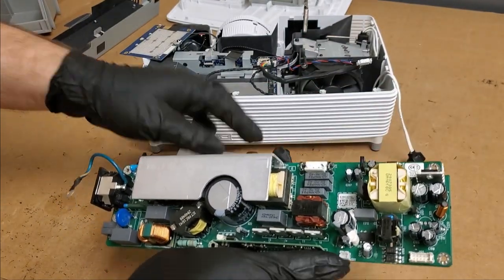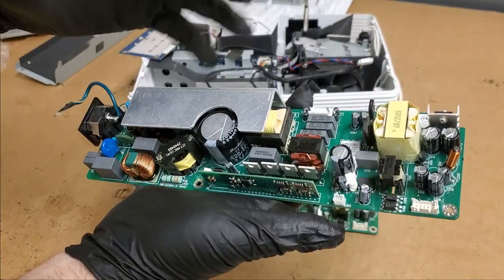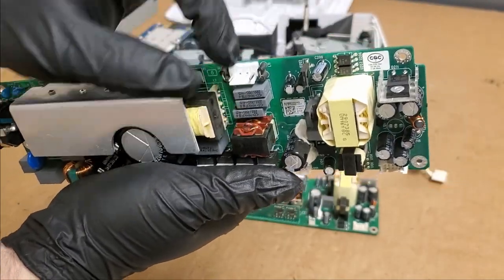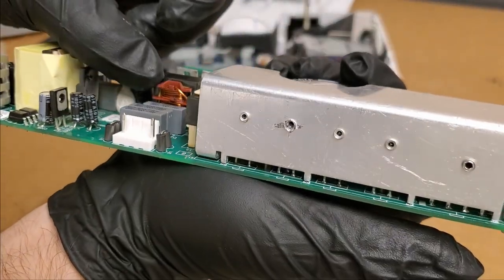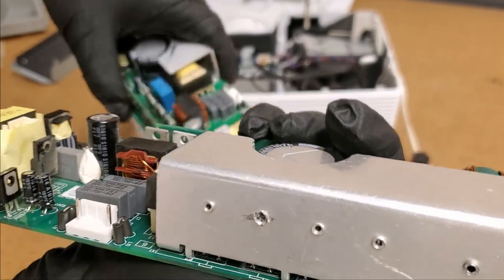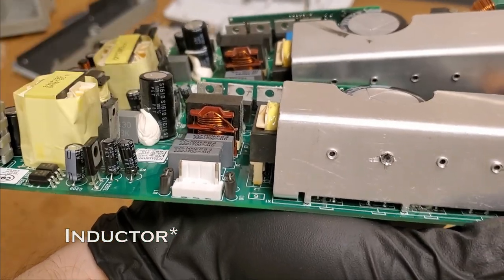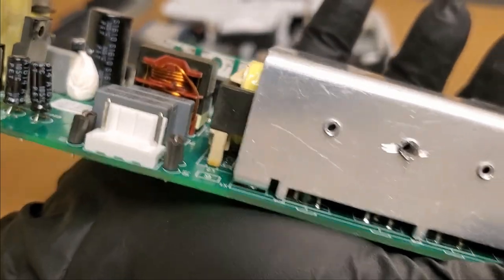I suspect either that or this, one of these two, or maybe these guys, something's partly breaking down. I kind of think it's this. I think that this ran too hot at some point, and maybe one of the coils is shorted inside, partly shorted. You can see, I guess that's glue they put on there. I assume that's glue. Oh, maybe not. Yeah, I'll bet you that's what happened. I'll bet you that transformer got too hot. Because you can see there's like some goo there. And then here there's not. So it looks like that plastic started to melt.